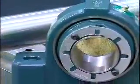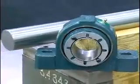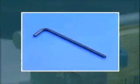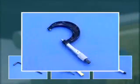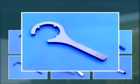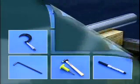We'll be mounting a 2 7/16 inch pillow block Imperial bearing. The tools required to mount the Imperial bearings include an Allen wrench, drift, hammer, marker, a micrometer, straight edge, and a torque wrench to tighten the base bolts once the bearing is mounted. Baldor also offers an Imperial Impact Spanner wrench to simplify the installation process.